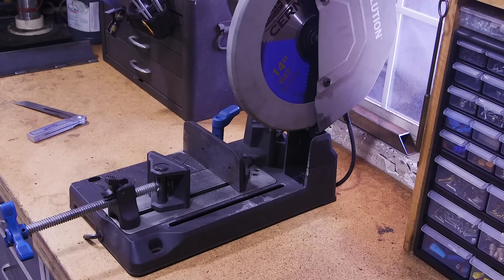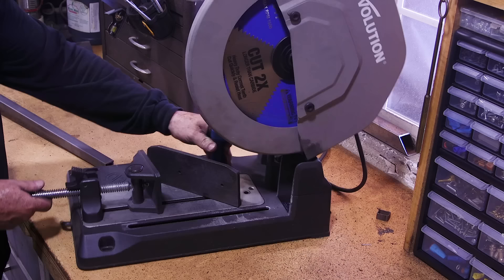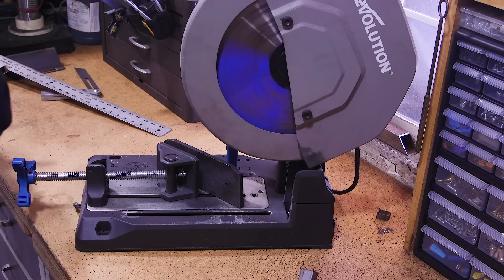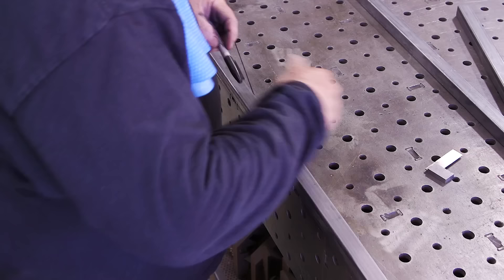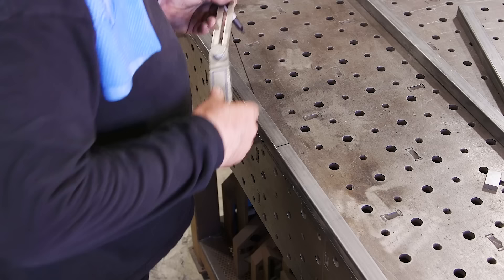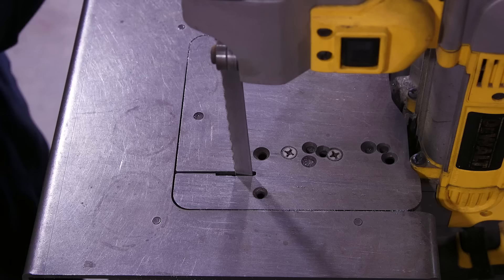I'm starting out with simple layout on my welding table. If you've got a small enough project you can just lay your job out on the table. We're starting off with one inch square tube, 063 wall thickness — pretty thin material. Originally I figured I just needed some lightweight material, just a cover to fit over the top of the opening, but as I'm building things it just gets heavier and more heavy duty. I just like building things super strong.